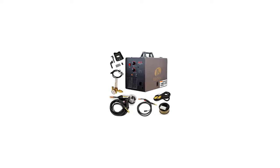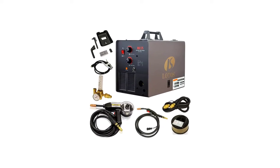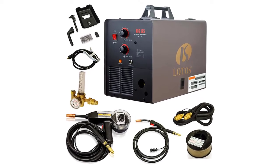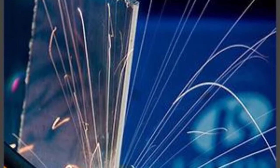The transformer coil uses high-grade copper wires that make it durable and ensure reliability. While operating at 220 volts, this model was able to provide amperage ratings as high as 175 amps. This unit is pretty heavy, similar to the Hobart 210, so it would be wise to set it on a cart. Fellow welders were blown away by the extra accessories this brand offers, like the Argon regulator. The settings are pretty sensitive, so you have to be careful if you want spatter-free welds. Although the company offers extra accessories, some are not of high quality — the welding gun, for example — but it still makes my list and I would highly recommend it to aluminum welders.